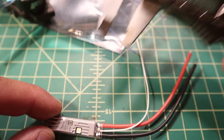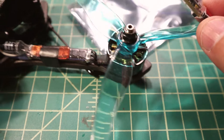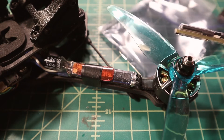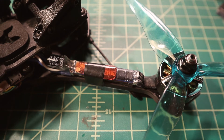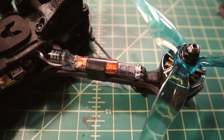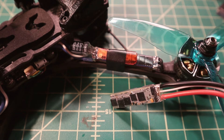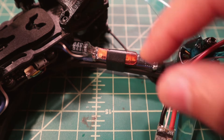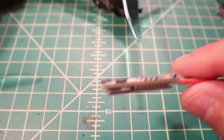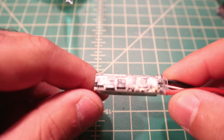The main key is that it's actually shorter. I like that because one worry I have with the iFlights is that the longer they are, the more leverage - so when you break an arm there's a bigger chance you might snap or bend the ESC. I use foam at the bottom so there's a little movement in a crash so it can give and not actually bend. This new one being slightly shorter will be better in the crashing department.